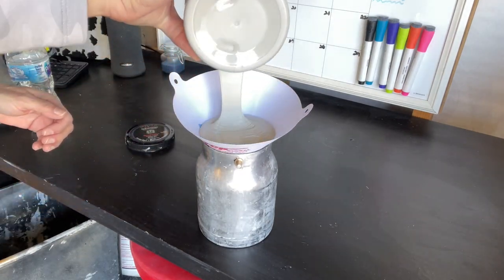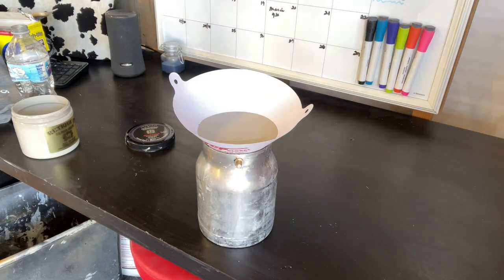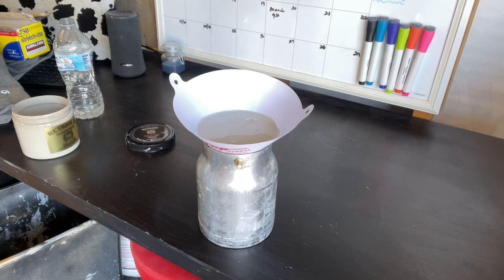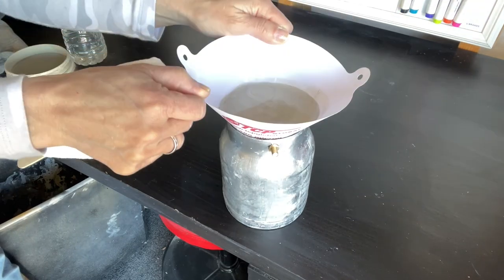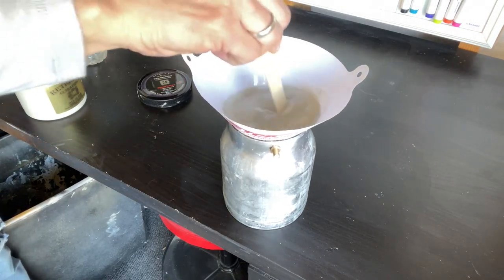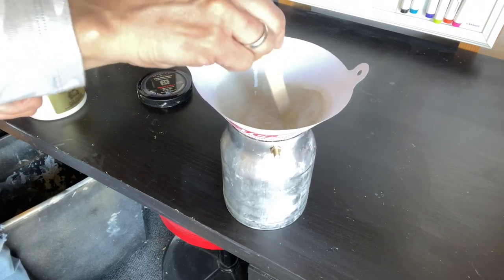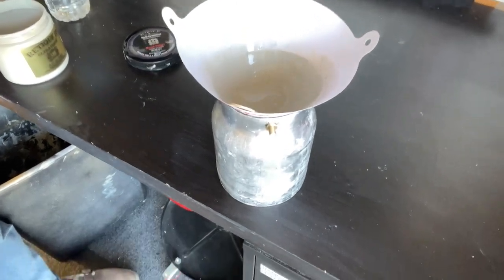Time to get to the spray segment. I've got my filter and I'm going to put my paint in and dilute it a little bit. I have videos that talk about diluting and using a viscosity cup, but I pretty much eyeball it because I've been doing it a long time. You can see how thick this paint is — it's barely even draining through the filter. You can see why you need to dilute it before spraying; there's no way it's going to push through the sprayer otherwise.